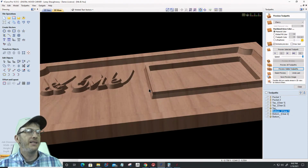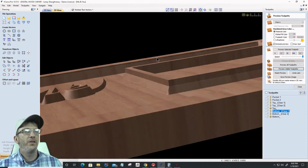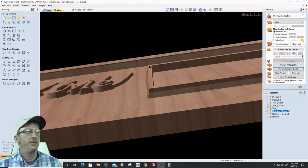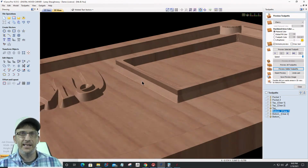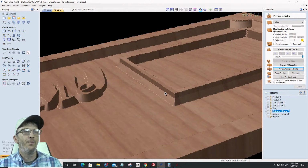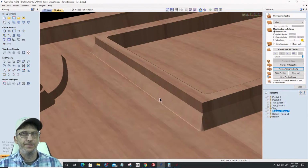Okay. But my frame here basically has this straight edge where the V-cut actually started here at the same level, right? And then as it went down that 1/8 of an inch and that 1/8 of an inch, it was cutting outward from there. But the outside of the bit came in and created this kind of straight edge. It's cutting on the outside, and there was no offset for that, right? So even though the software doesn't warn me, that's a bit of a collision.